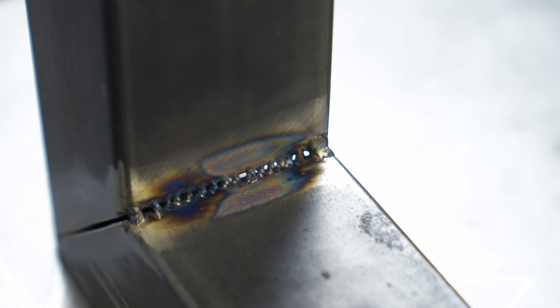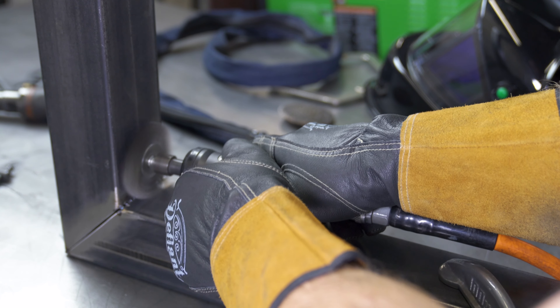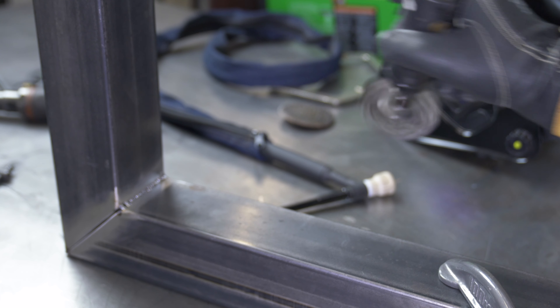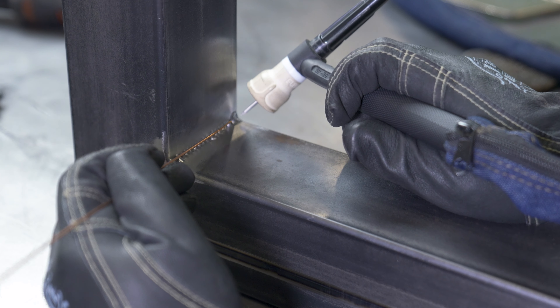Here's what it looks like after. It doesn't have to be pretty — it could be a little more even, but you're going to go back over it with your final weld anyway, so you really won't even see this. Before welding it, I like to get all this blue oxidation off because I feel like that draws into the next weld. I'm going to use a wire wheel just in case the weld is still a little bit warm — you could use a Scotch-Brite pad, but if it's too hot you might burn some contaminants down in there. Now the weld's cleaned and acetoned off, and we can go back over it with the last pass.